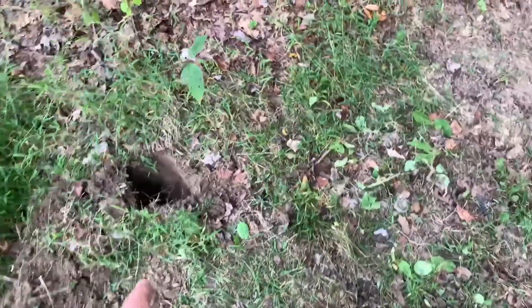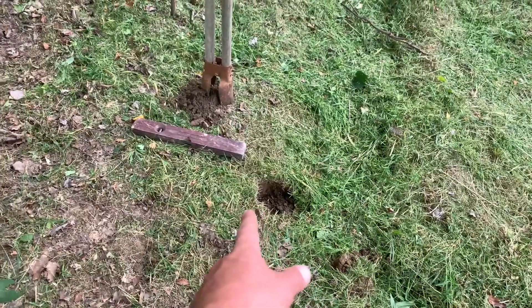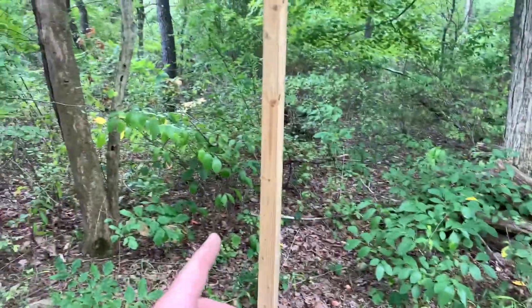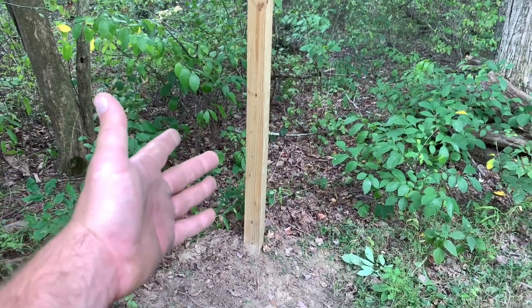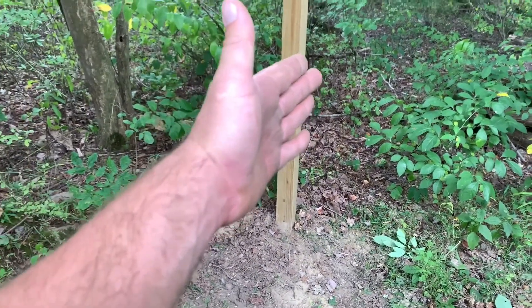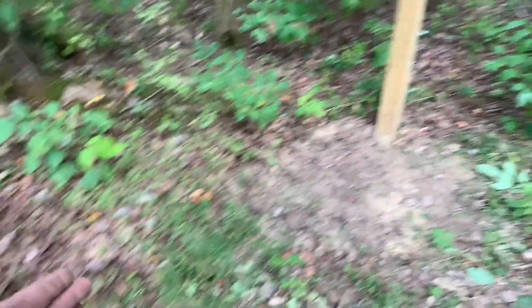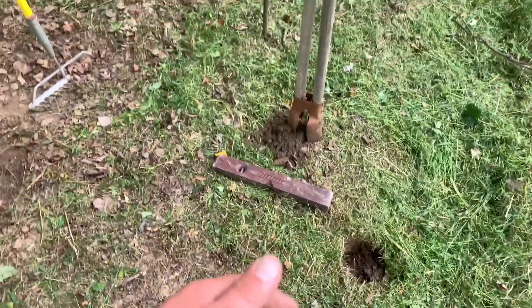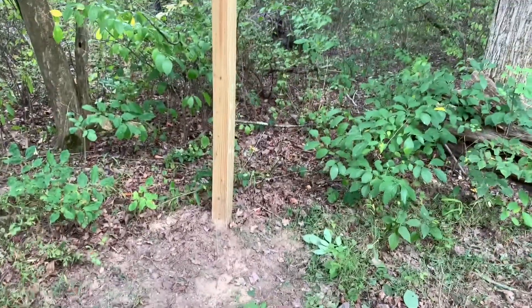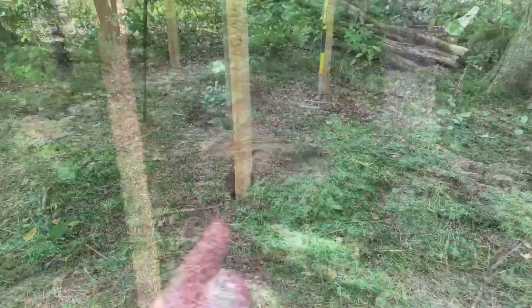What I came up with is I measured from this post hole to that post hole and diagonally the other way — complete opposite. I got 104 and 104 inches. I put my tape on there — I should be using a string line, but the accuracy is not needed in a tree stand. I did a makeshift string line with my ruler and both posts line up six feet, perfectly square. So we're perfectly on point for squareness. We'll just have to keep worrying about plumb now. Number three is in.